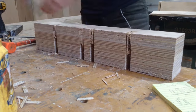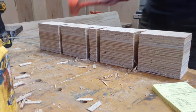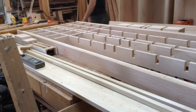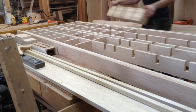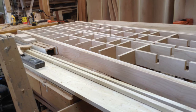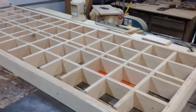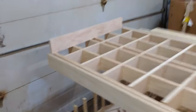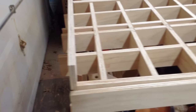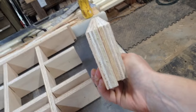I was making this really quickly and it didn't have to be structural. When you see the install, this is basically just a four-inch spacer, so the spacing in the middle is very close together. I probably could have gotten away with three verticals, but I was spacing it out quickly without paying close attention. None of this affects the final product, but if you build torsion boxes you'll notice this is extremely over-built — it could have been thinner wood with less spacing, but I had the wood and wasn't going to recut anything.